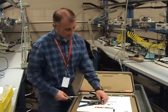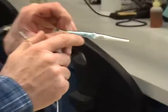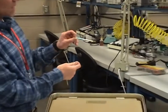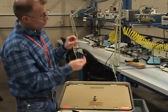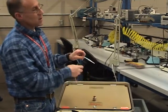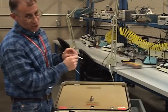With the blue and white, you have an insertion and removal tool. It even says on here: blue is your insertion, white is your extraction. Typical extractors and insertion tools are white in some other color — white is always your extraction. That being said, there are special orange and yellow, orange and blue, orange and red that you're going to have to look up.